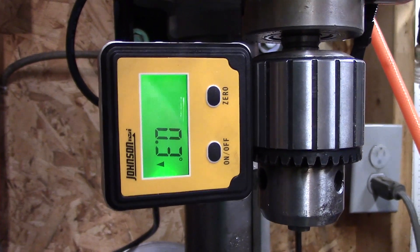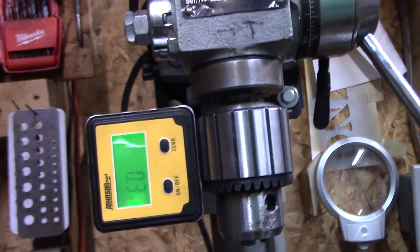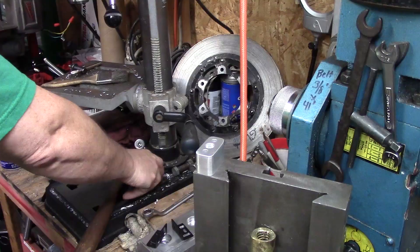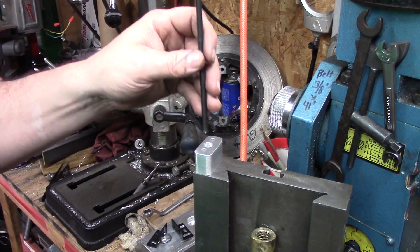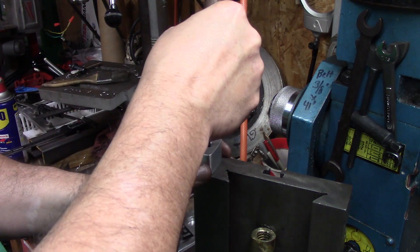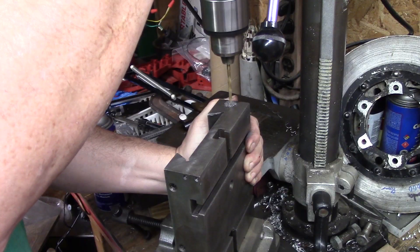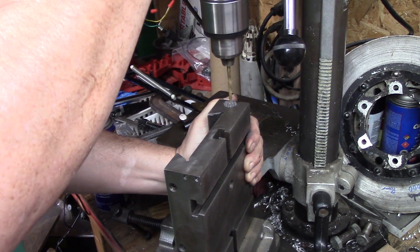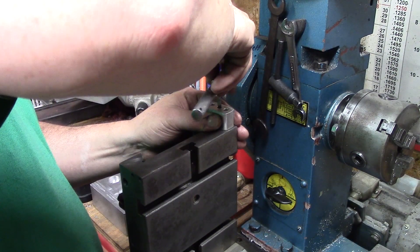And we're about 0.3 of a degree difference to the chuck — I think that's acceptable. Okay, I'm going to punch the middle hole first and then go ahead and drill it and mount it, so that way I know that the other two are on perfectly.